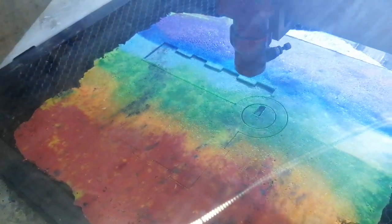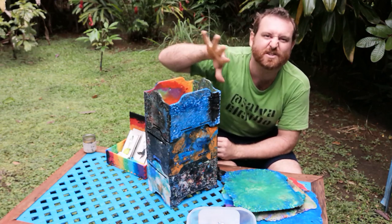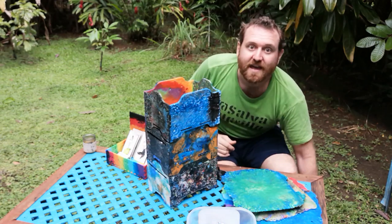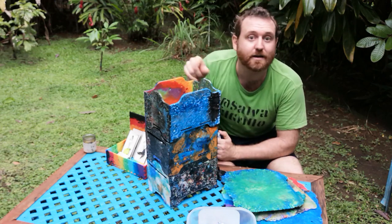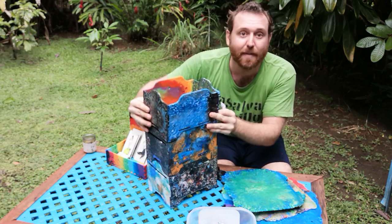This stops too much energy from getting soaked up in one part of your plastic sheet and starting to melt everything around it — instead it just chips away your design over and over again. All of these parts were cut with 10 passes.